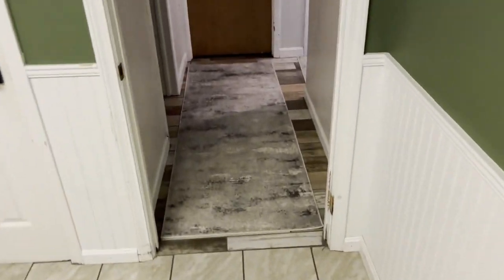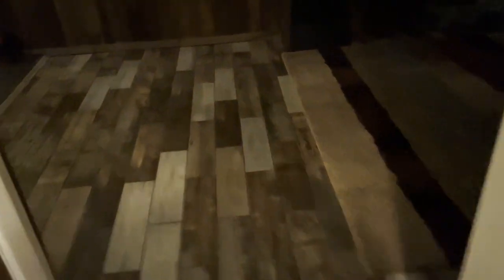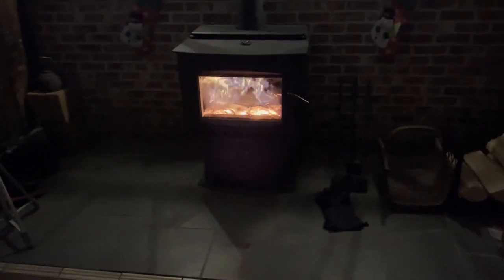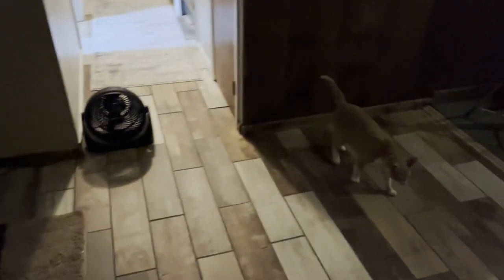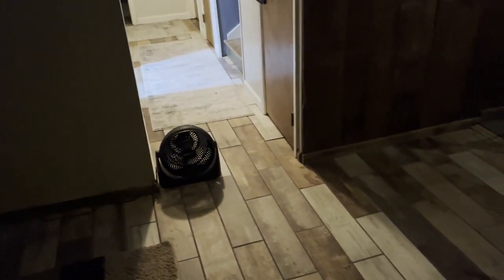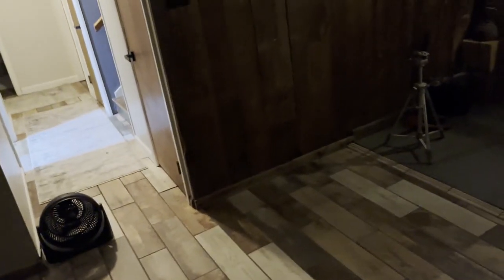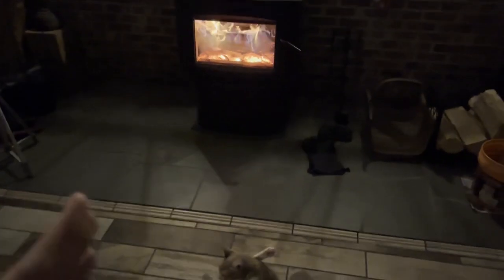This might kill some efficiency related to the wood stove, but as long as you've got wood it's not costing us anything — no blowers, nothing. I do have a fan running that blows cold air into this room, which is another tip: if you can blow cold air from the rest of your house into the stove room, it creates natural convection. Cold air comes in toward the stove, hot air rises and goes out through the rest of the house automatically.